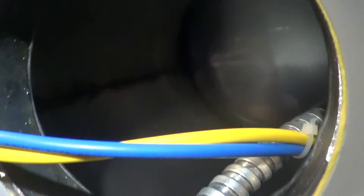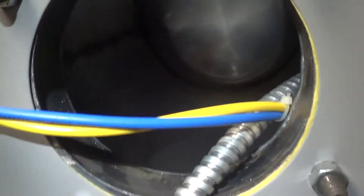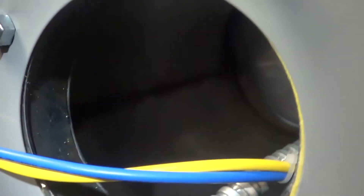Here you can see the heat exchanger. It has one large fire chamber on the bottom. Notice it's not insulated, so you want to make sure your flame doesn't touch the metal, because the metal is not going to take direct contact. The flame needs to fill up the void.